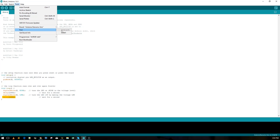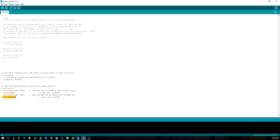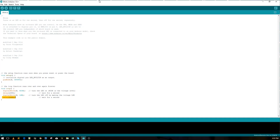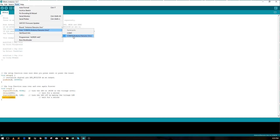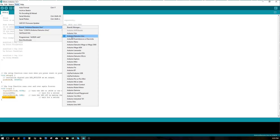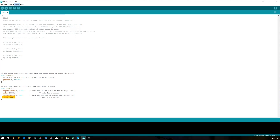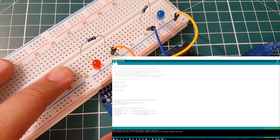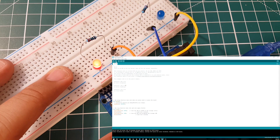To upload, go to Tools, then Ports, and connect the Arduino to the PC. Mine shows up on COM18. Then go to Boards and select the correct Arduino — for a Nano you'd choose that option. Hit Upload. Now we should see pin eight, the red LED, go on and off every second. And as you can see it's working perfectly.